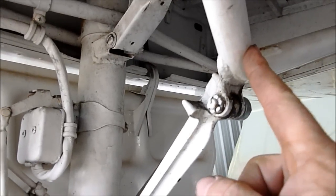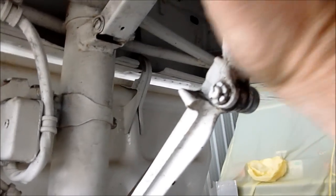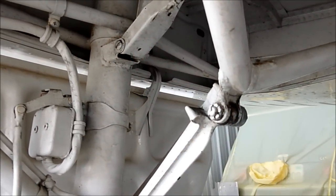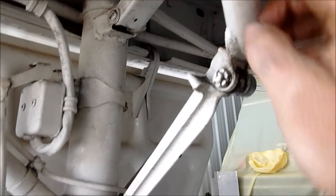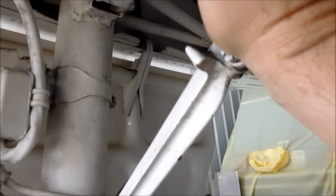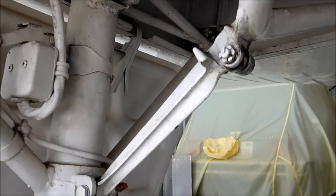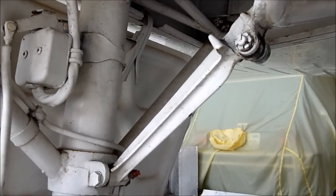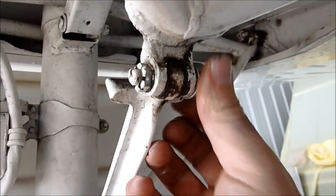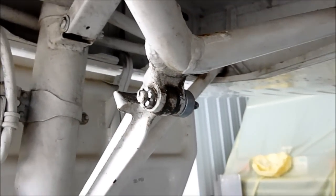There's also a procedure for checking the over-center locking mechanism. It takes approximately 50 pounds of force, measured in that direction, minimum to prevent the gear from folding up. That works against the springs on the push rods that raise and lower the gear. A common pre-flight item on the Bonanzas is to make sure this up-locked roller rolls easily so that the gear will come down.